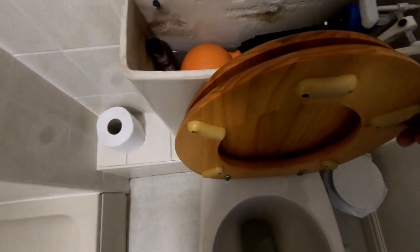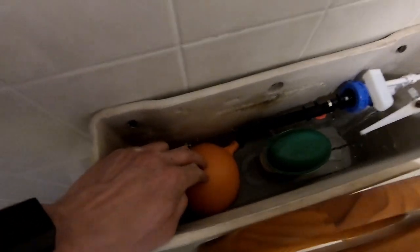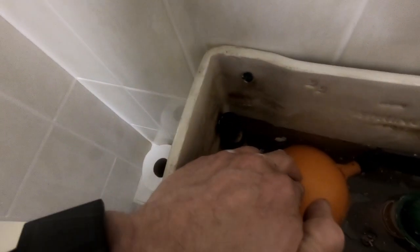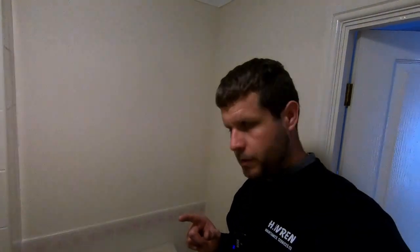I'll quickly show you this. I'll hold the toilet open and press the ball valve down to let the water level rise. That's rising up and if we look down there — without dropping the camera down the toilet — it should start to run down the siphon spillover before it gets to the overflow height. It's getting pretty close... yeah, there we go, it's starting to do it. So that's how it would overflow down there rather than fill the overflow pipe — a much better way.